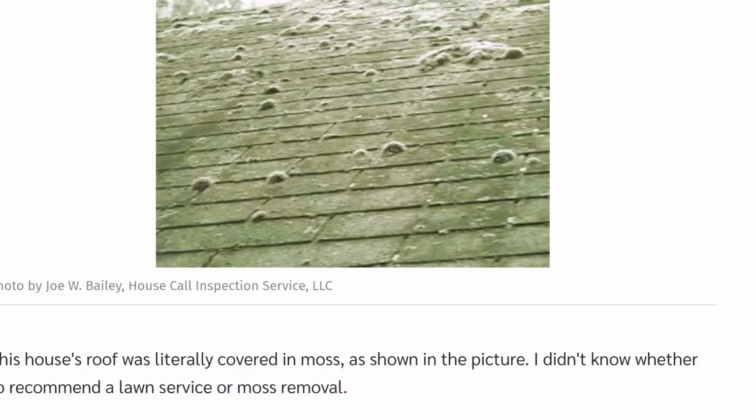Very nice. You know, with those, you can put a metal strip on top of your roof, and what'll happen is the water comes down off that metal. I forget the exact chemical something, but it will cause the moss and whatnot not to be able to attach to the roof. You actually see moss on roofs if it's really shady and stays wet, but you don't want it because the asphalt composition shingles are not waterproof. They're just supposed to shed water. If you have any type of growth on there, it's not going to be able to shed it, or it's going to retain it, which is not good.